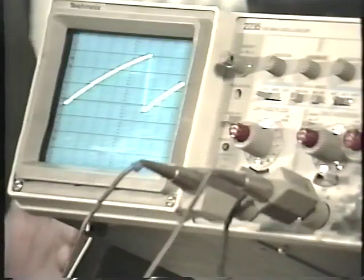And so there's all kinds of equipment now that uses what we call digital logic, and you really will need to use an oscilloscope to troubleshoot a lot of those kinds of problems. If you're working on jukebox amplifiers, you'll probably need an oscilloscope. When jukebox amplifiers develop funny little distortion problems, very often the only way to track it down is with an oscilloscope. Very minor problems like distortion in an amplifier are often pretty difficult to find using just a digital multimeter.